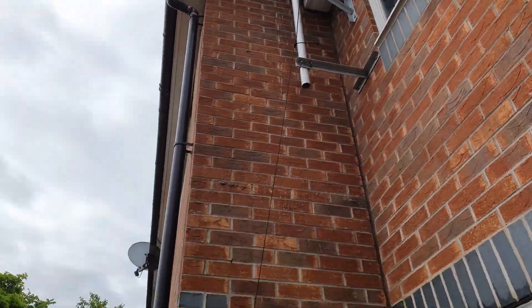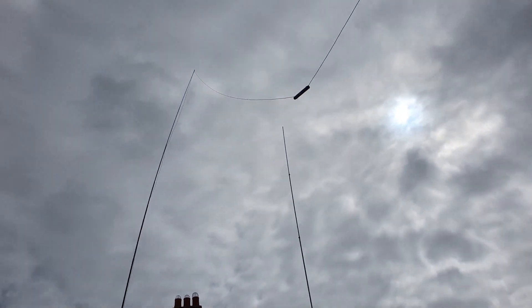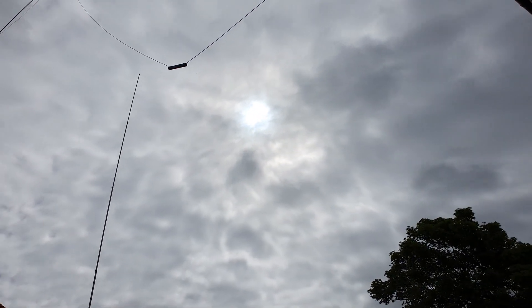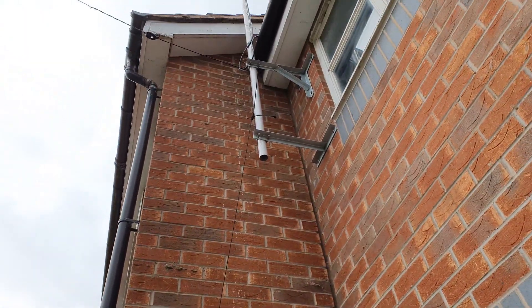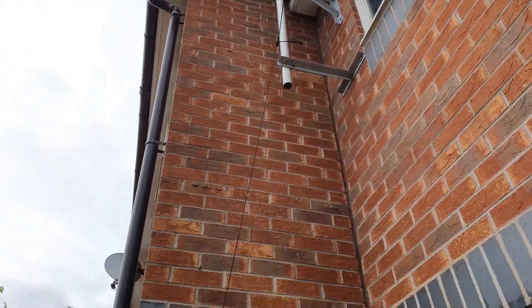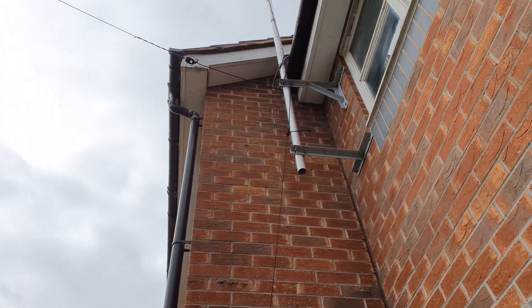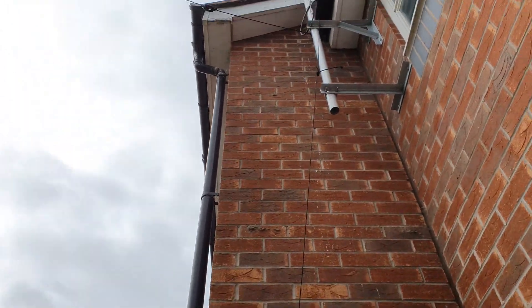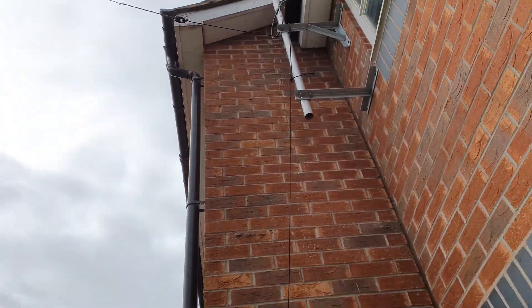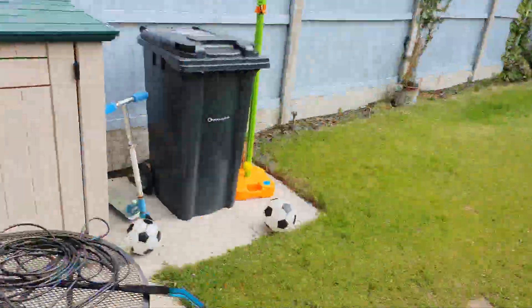So that's the configuration now. I had it on this point before and the angle between the very top and the vertical and horizontal was a bit too shallow. What I've done is put it up there - I just lassoed it up there - which has helped the SWR on 20 meters a little touch. It's a lot better up there and it's out of the way, so that's the first job done.